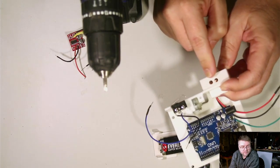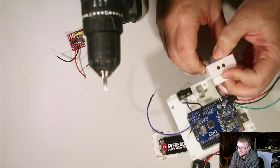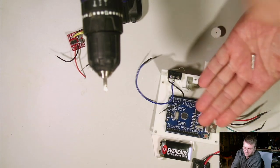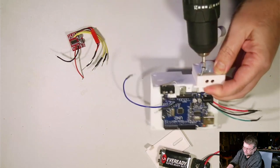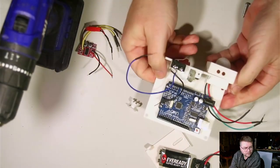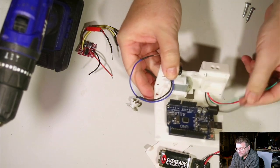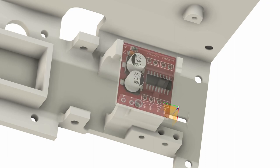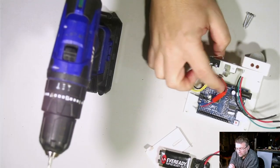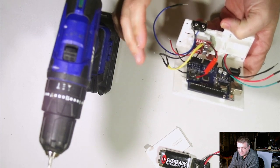The sensor holder has two adjustments. Just line them up with the holes and thread the wires through the hole in the back. It doesn't really matter if the adjustments face front or back, but front is easier so you can tweak it. The screws holding it down are about M3 by 18 mm. The motor controller fits in a little hole at the top and has a couple of standoffs to hold it in place.